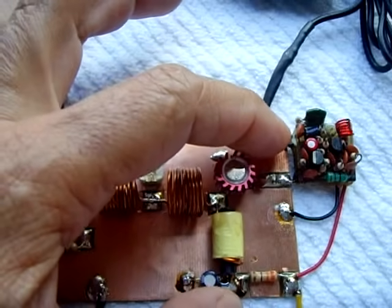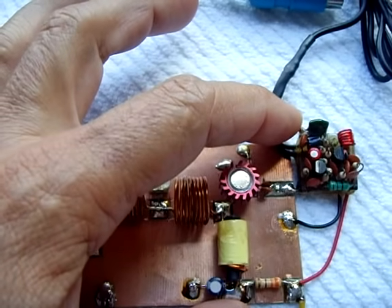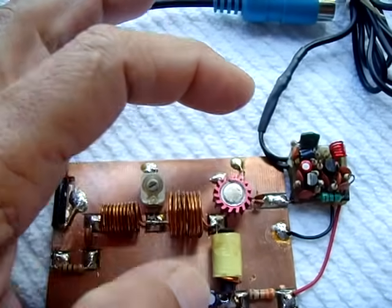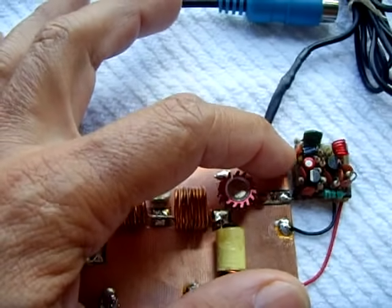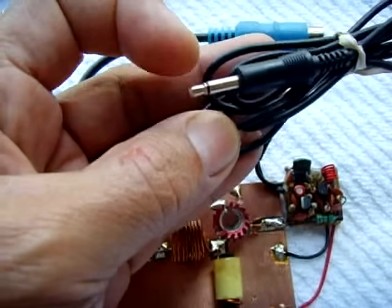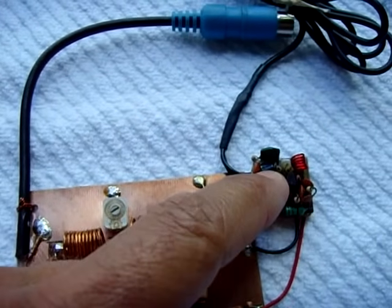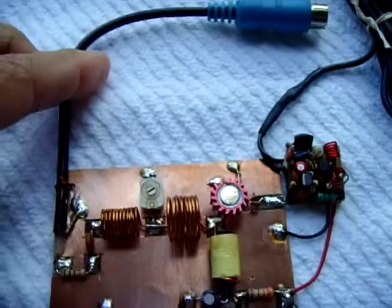If you have a transmitter and want to remove the microphone, it's very easy. Take the resistor that goes from the positive rail — usually a 27K or 47K — which feeds into the positive side of the mic, and eliminate that resistor. Then remove the mic. All you do is add a 47K resistor going into the capacitor that feeds into the base of the transistor, and connect that to your audio player. So the tip of the audio jack goes into a 47K resistor, then into this green capacitor, then into the base of the transistor, and now you can send audio from music versus a microphone. That's how you do it.